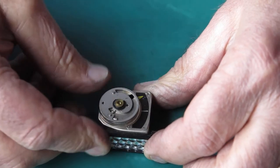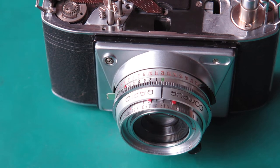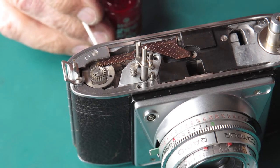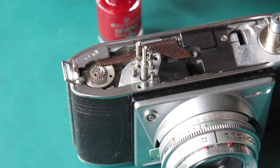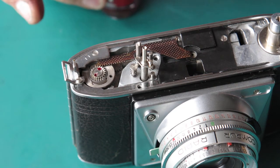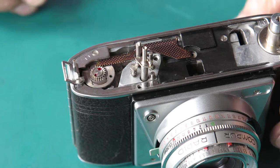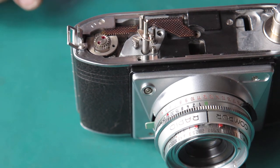Previously that was just oozing its way into position — it was not snappy at all in its action. In preparation for putting that back on top of the camera, I want to put a couple of drops of lacquer on the top of that screw so it can't work its way loose. Just a drop there and there — that's sufficient, that'll lock that screw. You don't need to paint the entire screw; some people think they need to paint the whole top of the gear bright red, but that's not the case and it doesn't help.